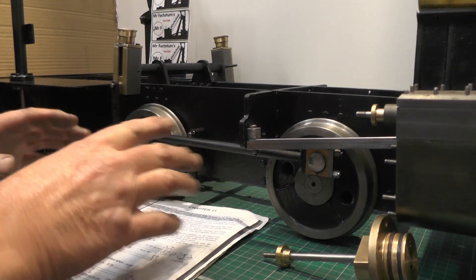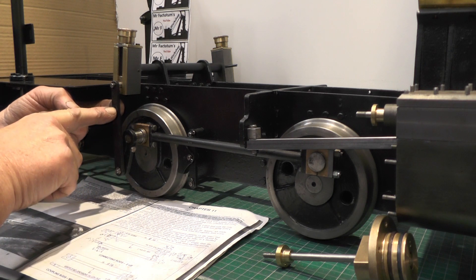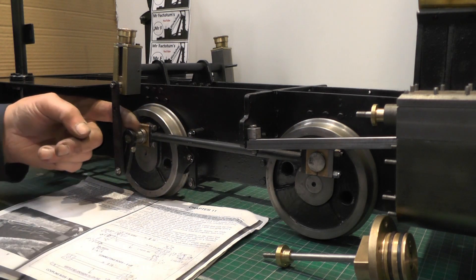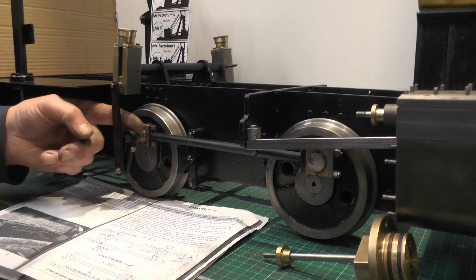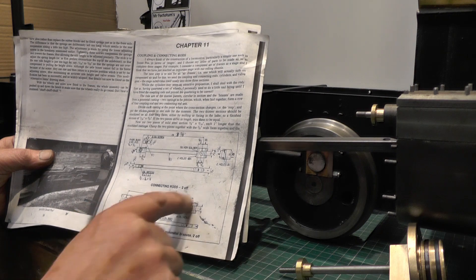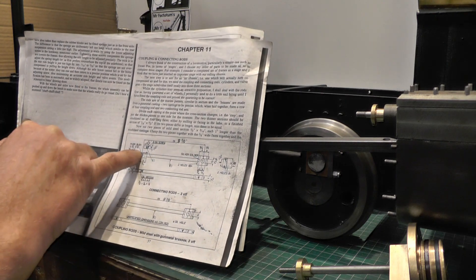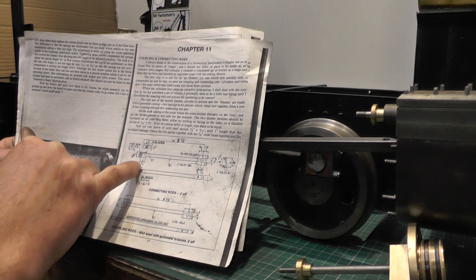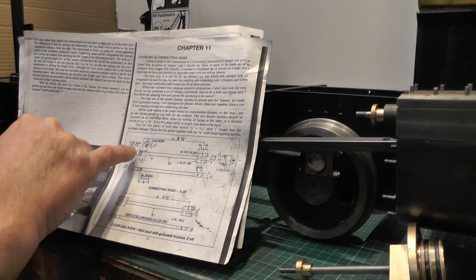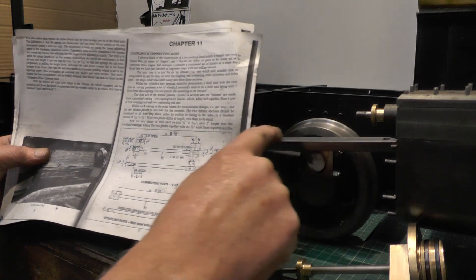Well on this part, there's still a bit more to do on this yet — I've got to make a valve rod that goes from this pivot point up to the actual valves. But in this part I'm going to make the connecting rod that fits on here. They're pretty much the same as the coupling rods, except the connecting rods have just got one set of brasses on, and then a connecting eye or lug at the other end with a phosphor bronze bush, and that end goes into the actual crosshead that slides on here.